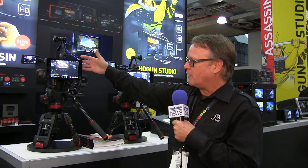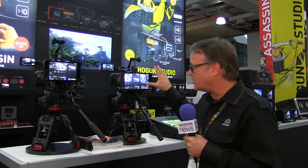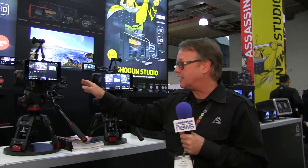What we have is our Shogun on-camera monitor recorder player, and we've simulated a multi-camera shoot — two cameras with a Shogun on each one, giving the operator a great monitor with all the tools, and also allowing an ISO record at the source. We're taking that output HD-SDI, and we're using a Connect series to convert an HDMI camera over to HD-SDI so it can be used in a more professional live event environment.